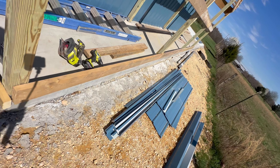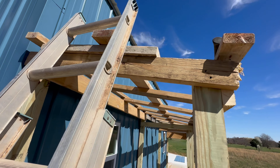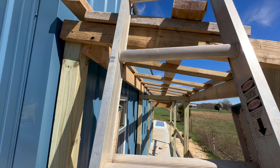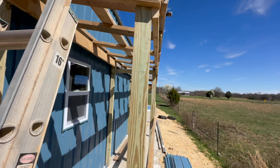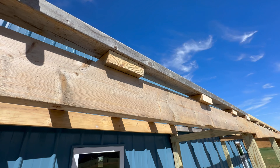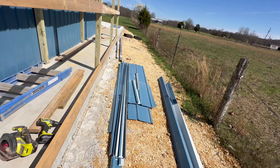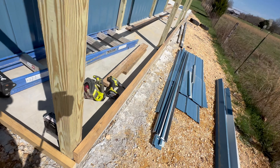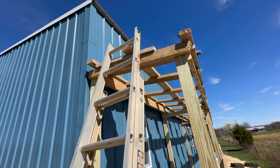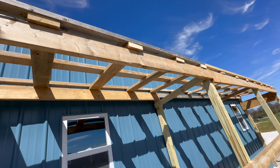So this J-trim is what I'm gonna use right up there under this board. I'll put another one up there — got a smaller piece — and I'm gonna do this back one at an angle so the next one can run under those boards coming out, all the way down. Then we just nail them up with some little roofing nails, hopefully getting them as flush as we can so there aren't too big of gaps.